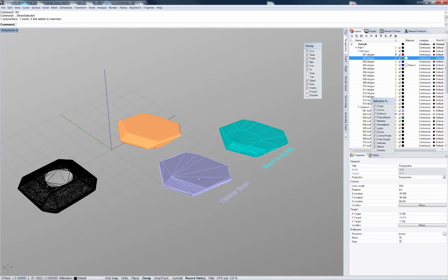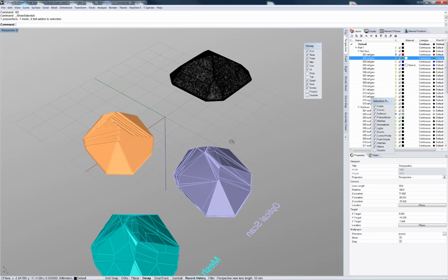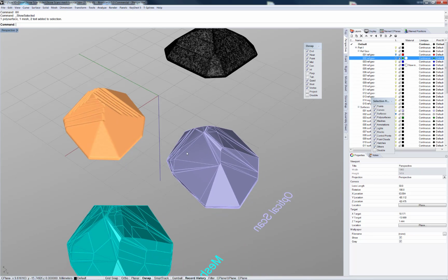Unfortunately, they cannot do things that have pockets or grooves, as in the Munsteiner stone, or a heart shape. As it's being occluded, it turns around on a little turntable, and as it's turning, the lenses can't see that. It's always being blocked, and it's basically looking at profiles and capturing vertices and edges. So if we turn this upside down here, we can see that we captured none of the grooves that are in the Munsteiner style stone. What the optical scanner does is basically a best fit of facets and just covers everything, and that's how it works.